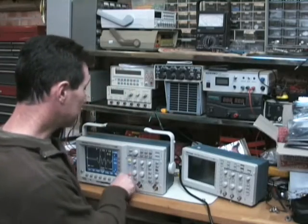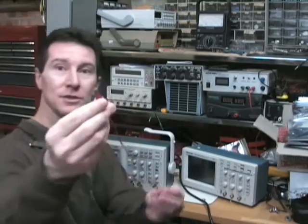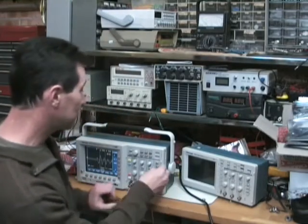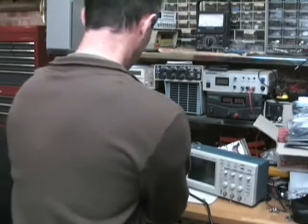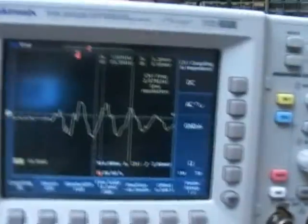Now, a couple of people have mentioned that it could be something to do with the anti-ground loop circuitry used inside some decent oscilloscopes. This could be the case — it could be a factor as well. So what we're going to do is 50 ohm input terminate the scope, and I'm just going to connect a clip lead onto the case of that, which is the ground. Let's give that a try. Bingo, there it is — check it out. 10 millivolts per division, roughly 140 megahertz again.